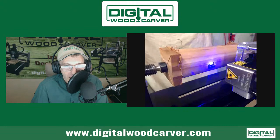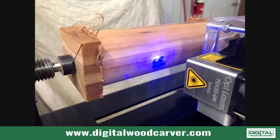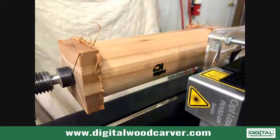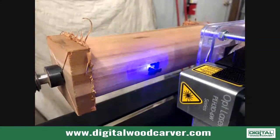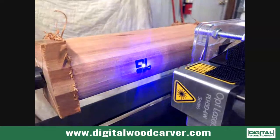And so what we see here is that laser engraving, that router, it's carving at a 45 degree angle right now. I have it rastering back and forth at a 45 degree. I like rastering at a 45 degree. A lot of people do offsets where it goes round and around and around. But what Burl was saying about the heaviness is that the detail underneath the digital is a little heavy and burnt. The reason being is we did not set the steps properly.